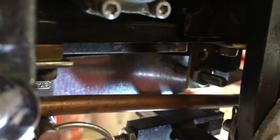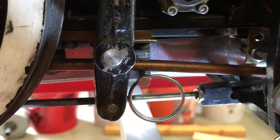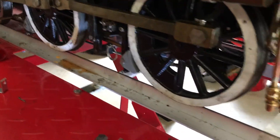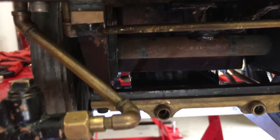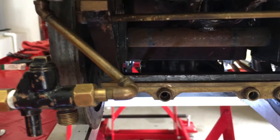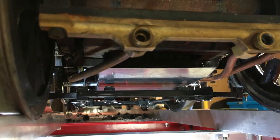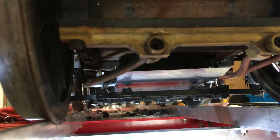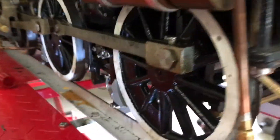I designed it so they can be easily cleaned. It was really difficult to clean in the past — in fact, it was just closed and I had to use a brush to pull the ashes out in the back. You can see the ash pan here, and inside it's pretty deep, so now the fire has plenty of room to breathe. I've also re-piped everything so the tubes are now on the side of the ash pan to go back to the tender, as opposed to right underneath it as before. So I redesigned it and made it really simple to clean.